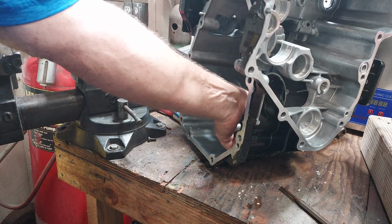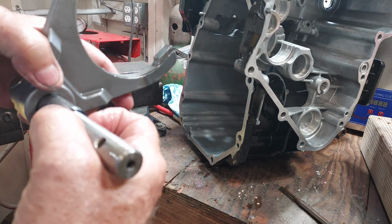Yeah, I probably messed with this for over an hour trying to get that diff lock lever to go in far enough so that the diff lock balls would disengage from the differential. The real issue was that I had the O-rings on the inside, two, then one. Then I finally figured out that no O-rings go on the inside, they all go on the outside. Once I did that, the differential would go in, the diff lock lever would go all the way in, and most importantly, the differential lock would disengage. This is the O-ring I'm talking about.